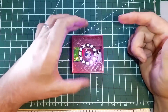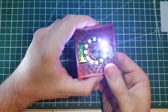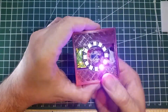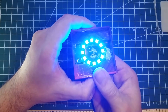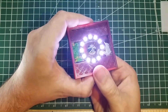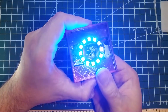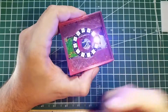What it does — how it does the colors and intensities at each step in the sequence — is randomized at the top of the loop, and it'll just keep doing this. I did add four buttons. Pushing the first one goes straight to solid red. Next one: solid green — that's intense for the camera. Then blue, which is reading almost as white on this camera. And then this is white at one quarter brightness. The blue is set to 150 out of 255 — these things are really bright.